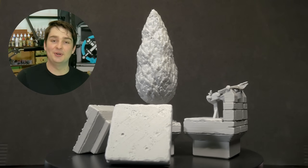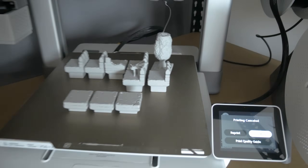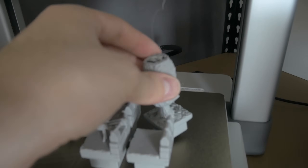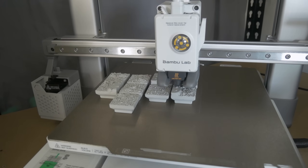Unfortunately, it was around here that I had my first issue with bed adhesion on the dungeon blocks tree, which popped off the plate mid-print. But to be honest, to this point I was very impressed with the build plate adhesion — I was really struggling to pull any prints off the plate until it had completely cooled down, so I hadn't cleaned it once throughout everything printed so far. After a quick spritz with some IPA and wiping it down with a lint-free cloth, it's been back to top-tier adhesion ever since.